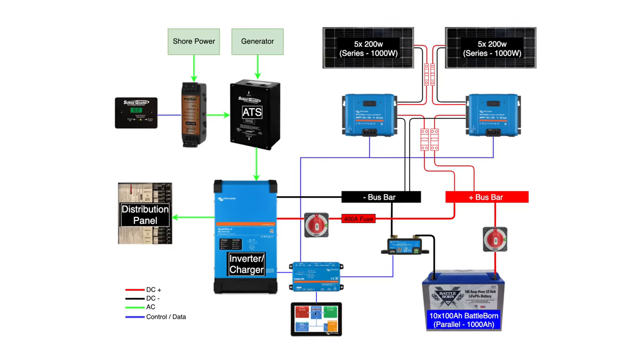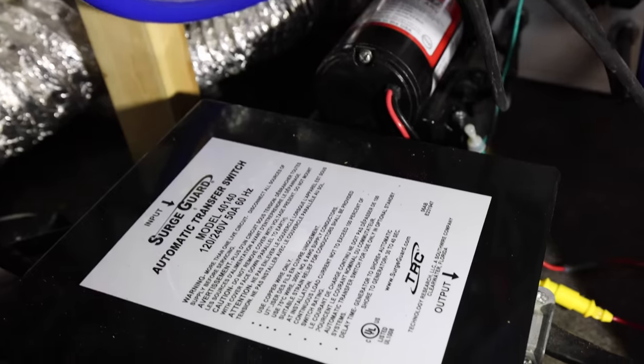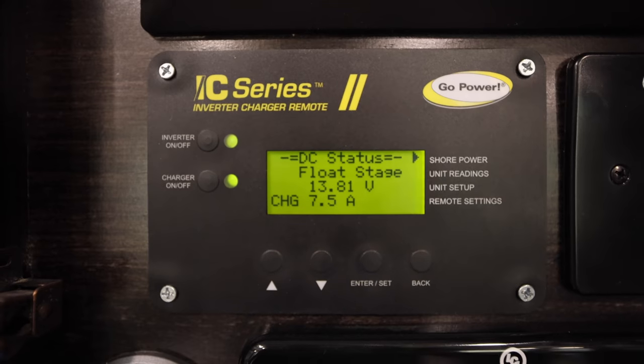A couple of reasons. First off, when we did the GoPower four years ago, it was really the only inverter of that size that I found that did full 50-amp pass-through. That means I don't have to have any sub-panels or crazy weird wiring or break out circuits. It goes straight from the ATS — the automatic transfer switch — straight into the inverter and then straight into the distribution panel, so everything in the RV is powered. Victron just came out with this; prior to this they did not have a model with full 50-amp pass-through. Victron also has a couple of legs up on GoPower. Some of my gripes with the GoPower: the interface wasn't great, there was no logging ability, no ability to control it remotely, and no way to see its interaction with other items like our solar charge controllers or our shunt.